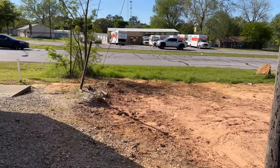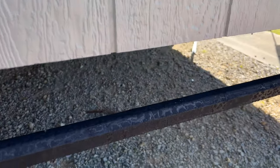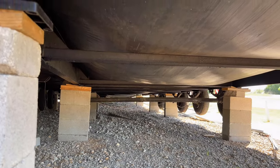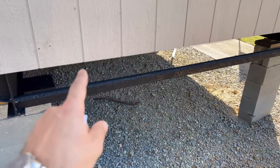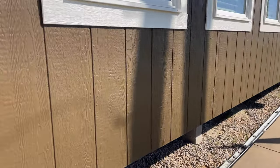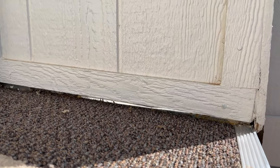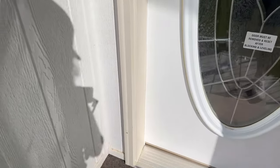One thing I'm going to point out real quick — I don't really bring it up on the double wides, but this is going to be a cross member. This is what's going to connect the two I-beams together. Something you'll notice about this cross member is that it's formed in a Z shape. The idea behind that is the more bends in opposite directions, the more rigid it's going to be versus a C-channel. I also got a good shot right here of that metal pan I was telling you about — you can see it goes up underneath the Smart Panel, allowing it to drain off the outdoor carpet.